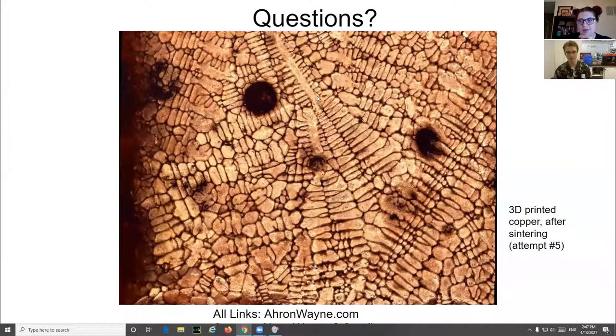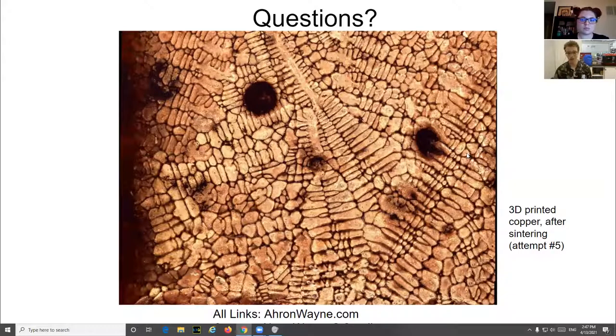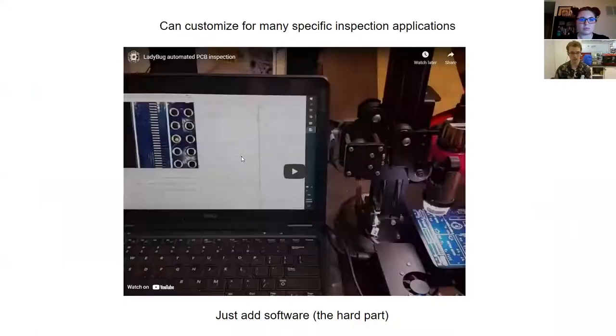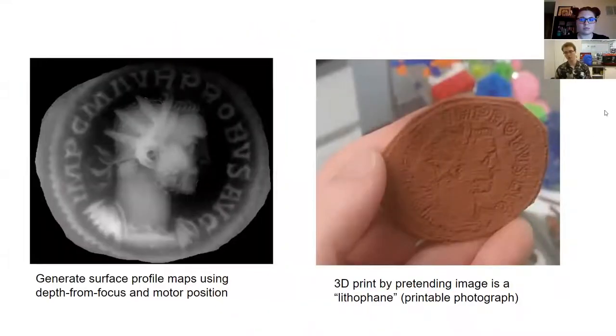The next question is from JD: what's your next metal 3D print? I'm still calibrating this. I'd like to do some circles and structural components — like dog bones — at different sintering temperatures, then pull them apart and compare their failure strength. I'd also like to make some biomedical things: teeth brackets, end effectors for surgical robots. And I'd actually like to sinter this Roman coin that I printed out and bury it in a Roman archaeological site to really try to confuse the archaeologists.